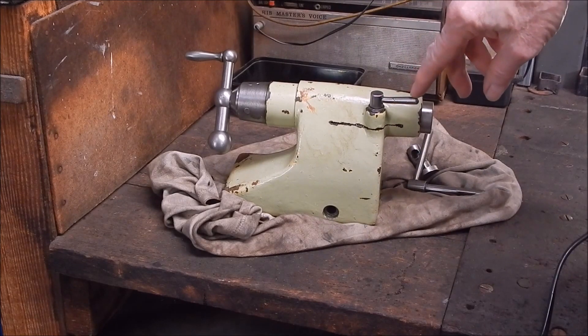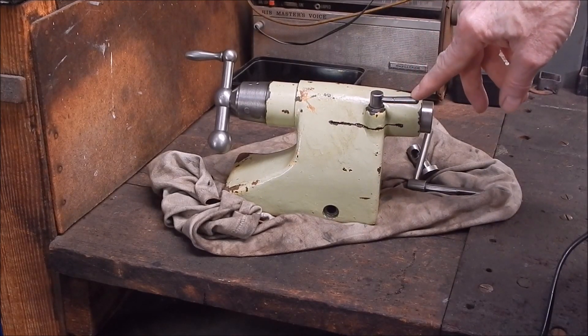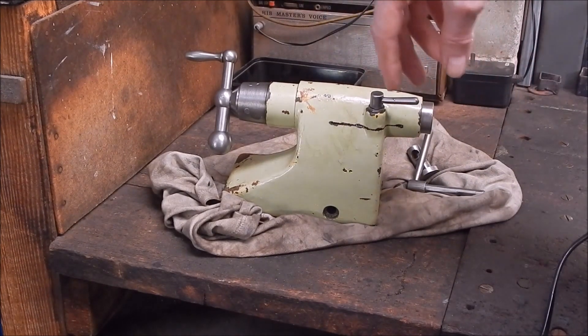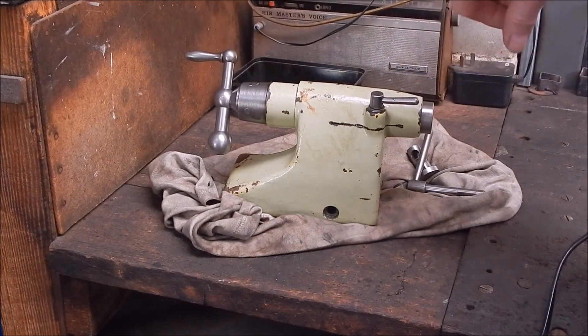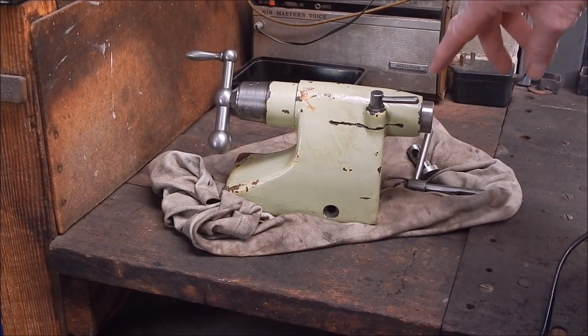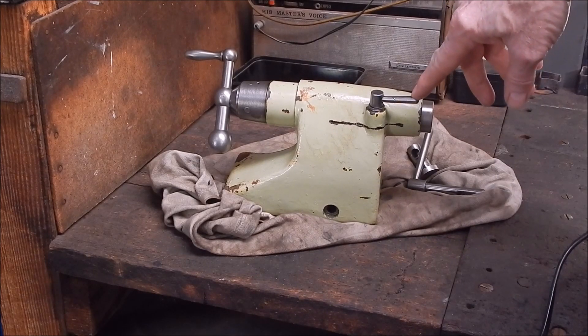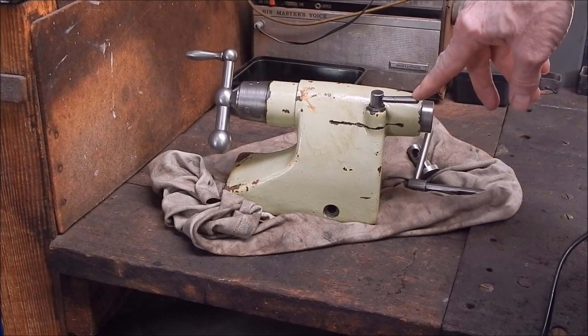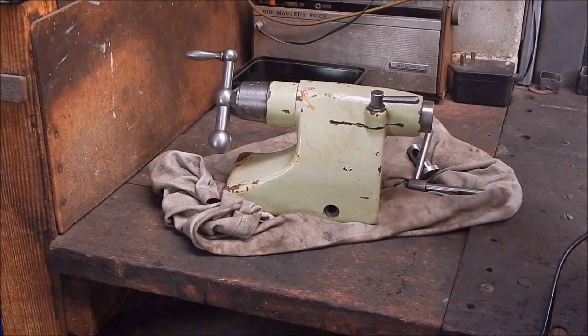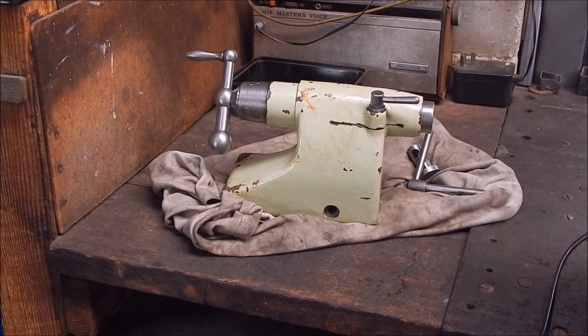Comes up good. That's what we really need to do for stuff like that. But you would have seen in the video there was also a little sort of angle indicator thing, really lightly built, all rusted up, and a little G-clamp and tweezers. Well, to clean them you don't want to use a wire buff because you could easily damage the stuff. It's a little angle finder - looks pretty interesting. So I'm using electrolysis to clean those and I'll just show you what the setup is.